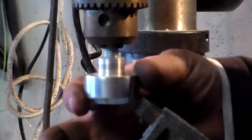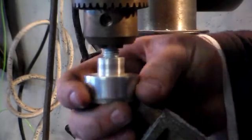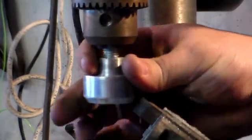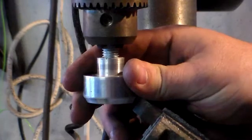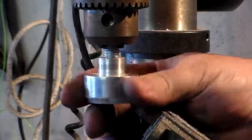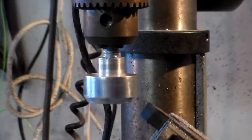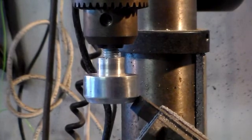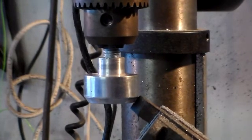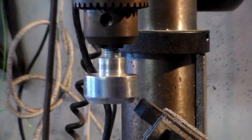As you can see there, it's working quite a nice chamfer onto the leading edge of this block of aluminium. I wouldn't use anything harder than aluminium — I certainly probably wouldn't go steel, or if I did I'd use a lot of lubricant — but certainly aluminium, plastic, wood, or anything like that, I think this is a great idea if you've got one of these cross slide vices on your drill press table. So there we go — using your drill press as a lathe. Thanks for watching.